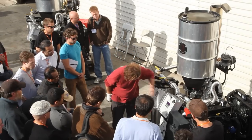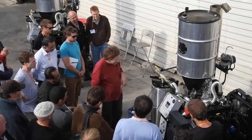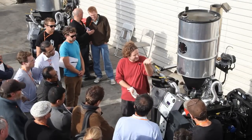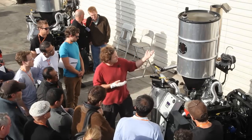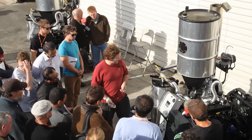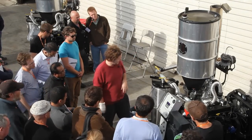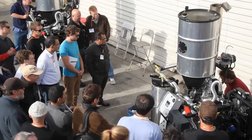Temperatures are still coming up — 500 at the top, 620 at the base — reversed, oddly. When these start up, all sorts of things happen depending on how the fuel is sitting. Sometimes the top comes up high and the bottom low as it should be, since temperature should drop through reduction. Other times, if it's sat for a long time with water, the water pushes down from the top and the top is cooler. Typically you run the startup long enough that they at least get even, ideally with top higher than bottom. If you've just filled fuel, it can help to shake it and get it seated.